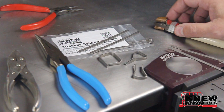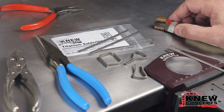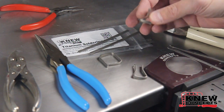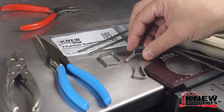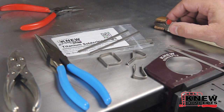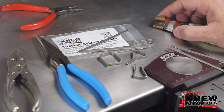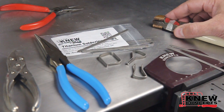It is one of what they call the reactive metals. When it gets hot, it reacts with things like oxygen and nitrogen, and it gets brittle. So instead of getting soft when you heat it up, it gets hard. It doesn't get so brittle that you can't flex it to make a clamp or to make your clamp work, but it does get so brittle that you can't then take a straight strip and bend it — you'll just break it. So you need to pre-form them before you fire them the first time.